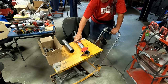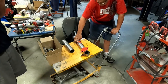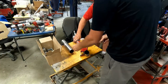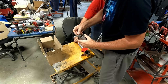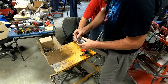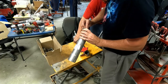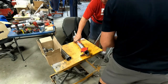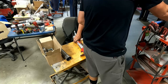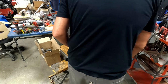Yes, sir. Okay, what gauge steel is that? Probably 8. Yeah, check that one. Is it 18? It's a little wiggly on that one. Too tight for that one. So we're going to call it 14 gauge. Wow, nice and thick. 14 gauge. There you go. .035, yep. We're on MIG.